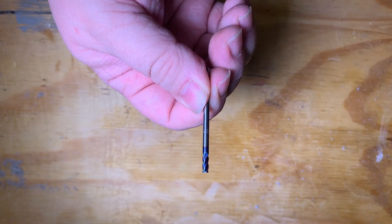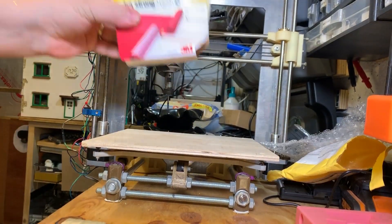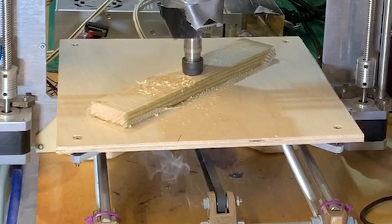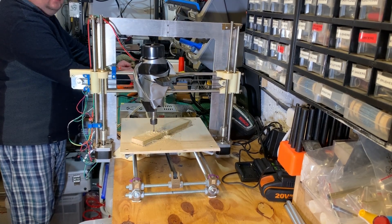I used Repetier to drive the machine as that's what I've used before on the 3D printer and I know it works — it's free and fairly easy to use. For the first cut I inserted a 3mm end mill, also from Banggood. I haven't used any of their tool bits before but I have found them to be great value on other stuff if you don't mind waiting a little bit longer for them to arrive, so I've got high hopes. Some scrap pine was stuck down to the bed with carpet tape — I love this stuff. It's double-sided, cheap, grips really well, and not so well that you can't remove the stuff afterwards. What happened there was my steps per inch was off — easy to fix in the code. I used ESTLCAM to generate the toolpaths as it can generate Marlin-compatible G-code, and again it's free and easy to use.